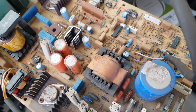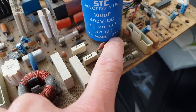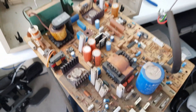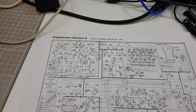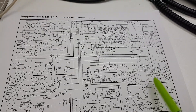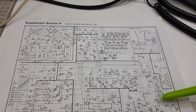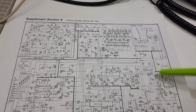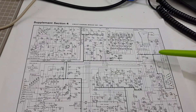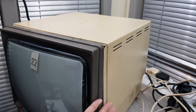Most of these capacitors probably want a renewal. If we get any picture at all on the screen then I'll do that, otherwise probably won't go any further. I think that might be the date code where it says 8437 - so that's 1984, week 37. The guys that designed this never expected it to be working in 2021. The things that really worry me are the very high voltages - about seven and a half kilovolts around this line output transformer. If there's moisture inside the transformer it could flash over and arc internally, and all of these coils are relatively custom for this monitor and not worth repairing.